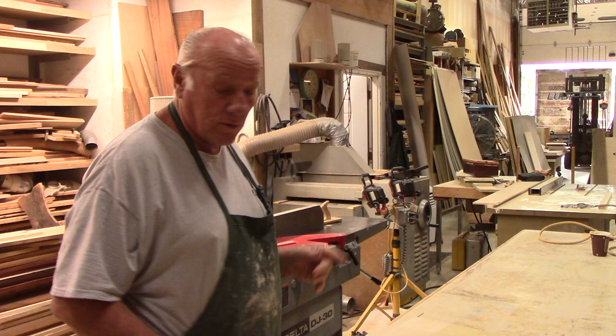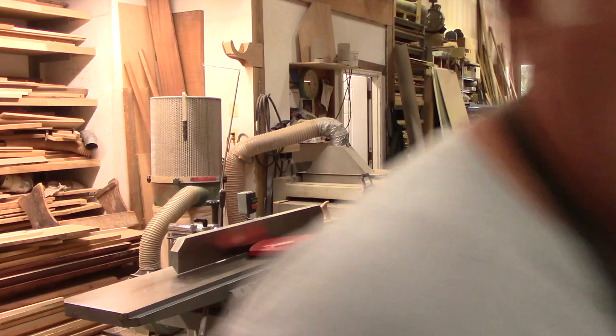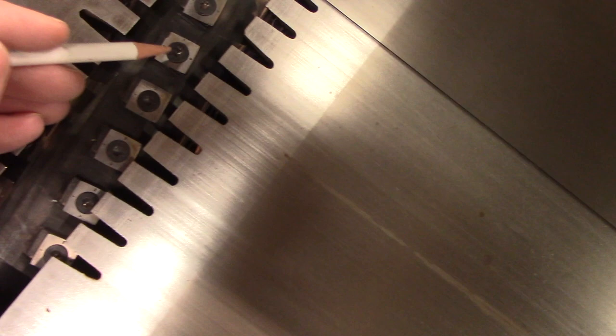I'm going to go over to a table saw now, and we're going to rip it to size, but first I'll show you that Byrd Shelix head. All right, so here's what I'm talking about with the Byrd Shelix head. They're pretty sharp. See these little cutters? They're all individual cutters. They have four separate cutting edges, so when one edge gets chipped or something, you can always loosen up this Allen screw here and rotate this, okay, and expose a new cutting edge. And once all four edges are used up and dulled, then you just take it off and replace it with another one. There's no sharpening of these, all right?